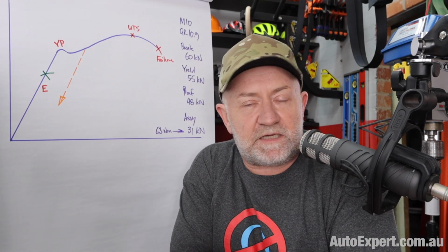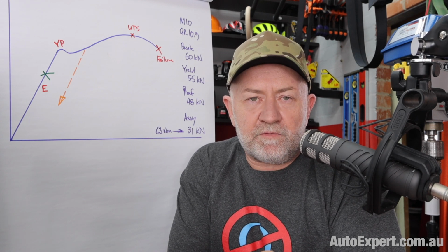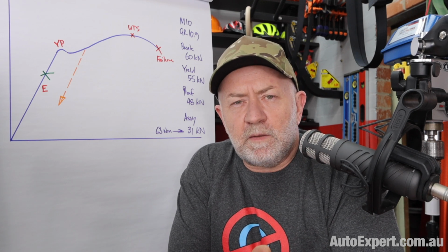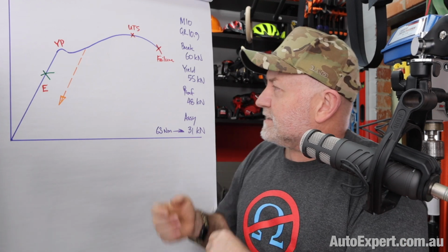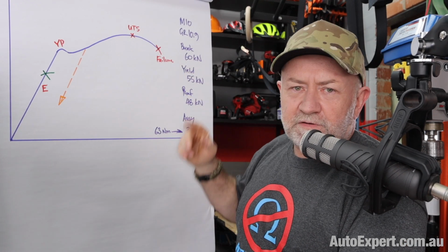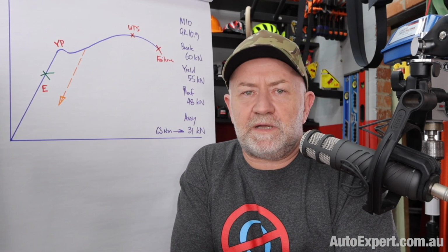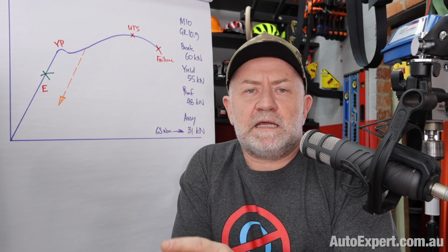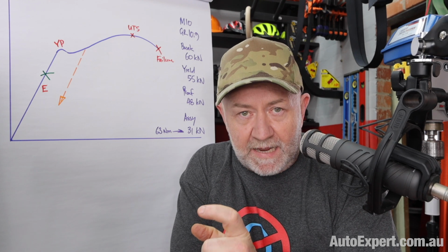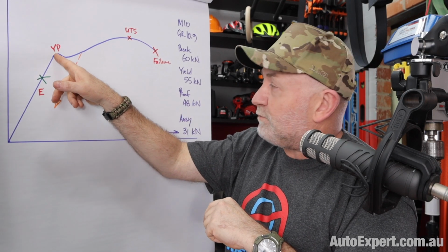And if you're going, oh, Jesus, a kilonewton? A kilonewton's about 100 kilos. It's actually 98.1 kilos, right? But just call it 100, because we're building engines here. So that's about 100 kilos, 60 lots of 100 kilos, which is about 6 tons. For an M10 bolt. And if you're in America, that's about 3/8 of an inch, okay? A high tensile bolt will break at about 6 tons of clamping force. But the yield point is going to be about 5.5 tons for a bolt like that.